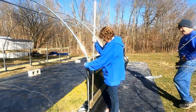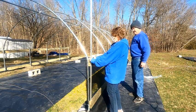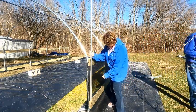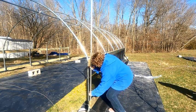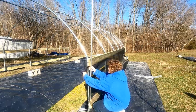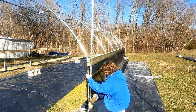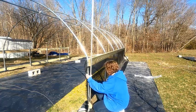We're going to temporarily put this up here, and then we're going to put the other tracking across here to seal this up so no insects can get into it. On the bottom here, we're going to tuck this under, and when it comes time to put this tracking in here, we will do the same down here, tuck it, and that will keep the insects out. I can pull this around on the side when we put the plastic up. Down here, we're going to pull it tight, staple across here, so we still have the ledge here for our roll-up pipes to go on.